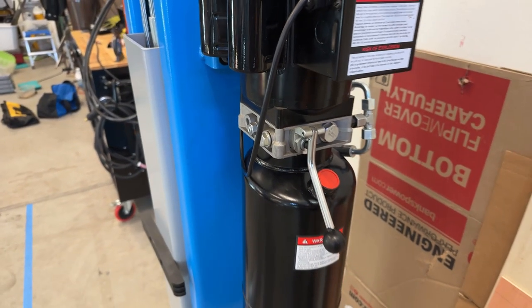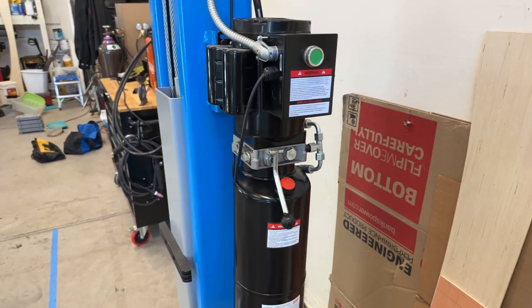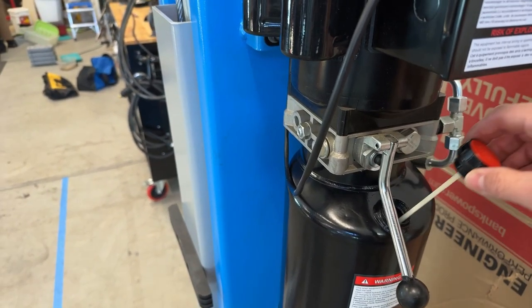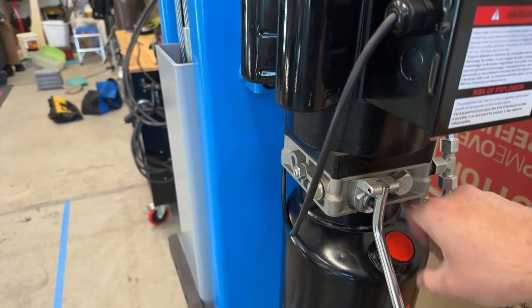Our last check on the lift is our actual pump assembly and fluid level. My unit specifically calls for an oil change once a year, though that may not be totally relevant if you're not using it in a commercial setting. The fluid level is full, there are no leaks, and it is still completely clean and clear — it smells brand new. From experience though, I did not change the oil soon enough on my BendPak lift. It uses Dexron hydraulic oil or transmission fluid versus actual hydraulic oil, and moisture built up over time, causing corrosion in one of my cylinders, which then required a rebuild. Take a look at your fluid, make sure it's topped off, that it isn't discoloring or changing in any way, and change it at whatever interval works for you.